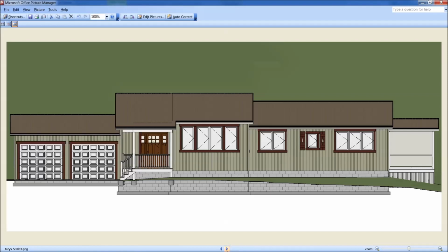But the next thing I did had to do with these. For one thing, I changed that transom over the door to the same type of material that the door is made of, and raised the door to a 7-foot-high door in that 9-foot room. And I added this casing, presumably because of the presumption of adding the siding around here, aluminum or whatever you would like, around these doors. And the same note with regard to squaring those off and saving money is in order.